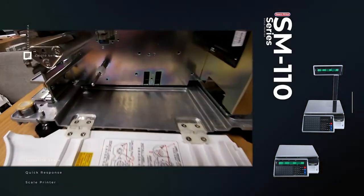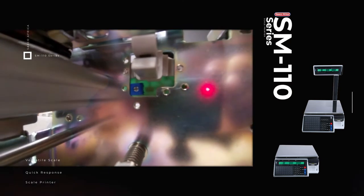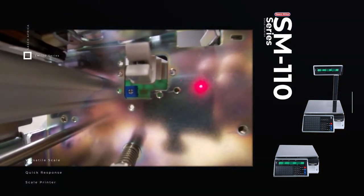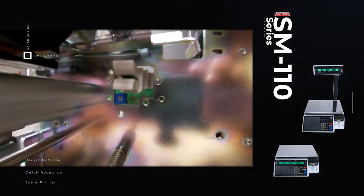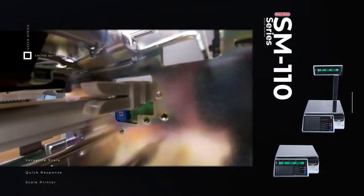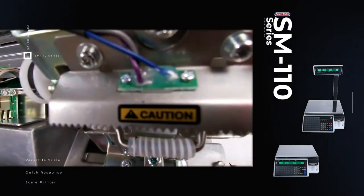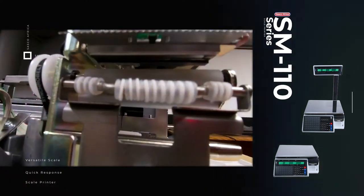The next part is your sensors. The gap sensor — always make sure your paper runs through that when putting it in the cassette. There is a little blue screw point that you can use to adjust your voltage on the sensor if you are having issues with the scale not picking up the gap. The peel sensor ensures there are no labels stuck or obscuring the label feed, and it sits at the bottom of the cutter.